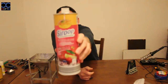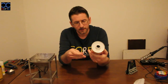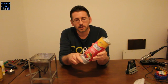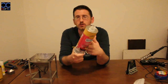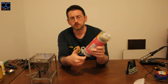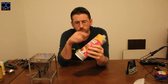What we're left with are cans you can find holding all sorts of things — like this syrup can. You can also buy motor oil in this design. We take the magnet and it sticks, so we know it's steel. These are often called tin cans, but they're not really made of tin — it's a sheet of steel covered with a thin layer of tin on the inside to prevent rusting. It's basically steel cans; nobody uses tin anymore as it's more expensive.